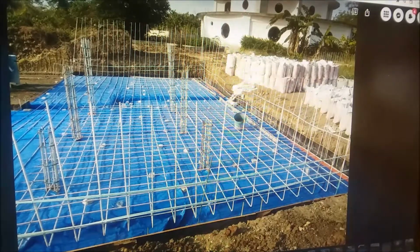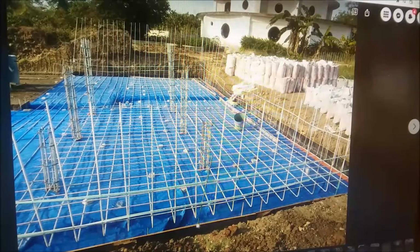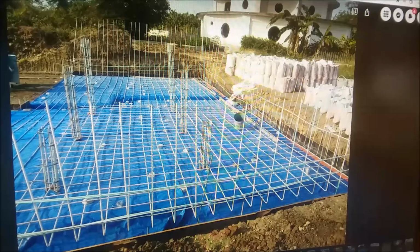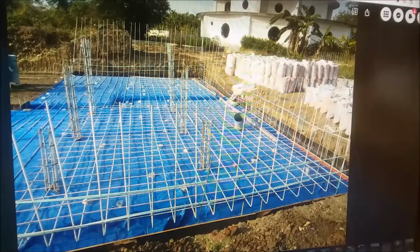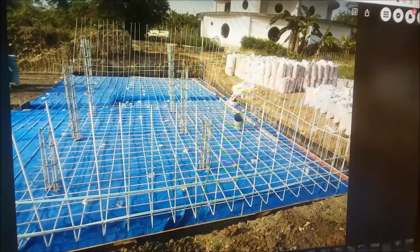I don't think there's anything noteworthy here, except that we're missing a bar right here along the bottom of these uprights, and then there'll be a piece every 5th upright comes out that we're going to set some bars on for the footer. Now I realize those will be 6 inches off the bottom of the concrete, which is closer to the top than the bottom. But the pressure will be probably pretty much on the top, and they're mainly to keep a crack from having two pieces wander away from each other. So I can justify having it up there rather than in the bottom of the ditch.